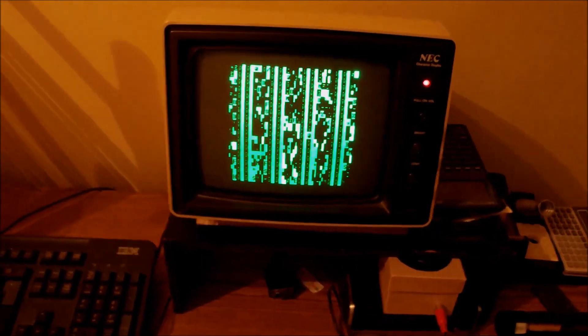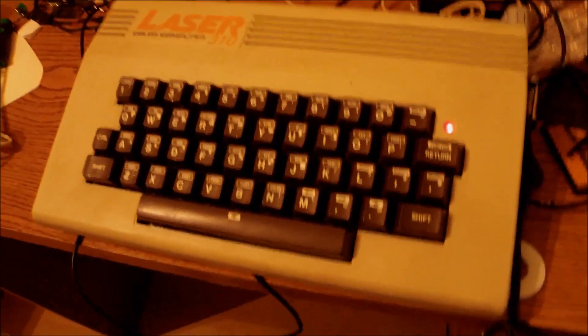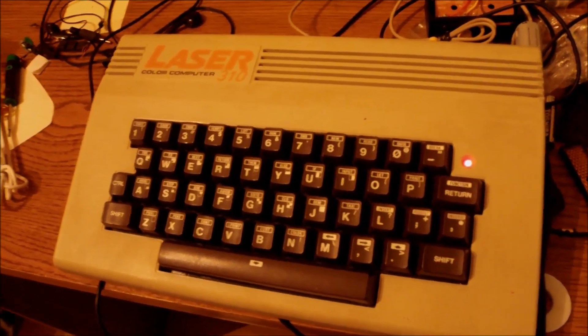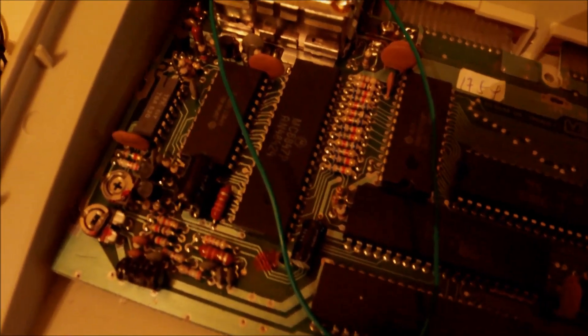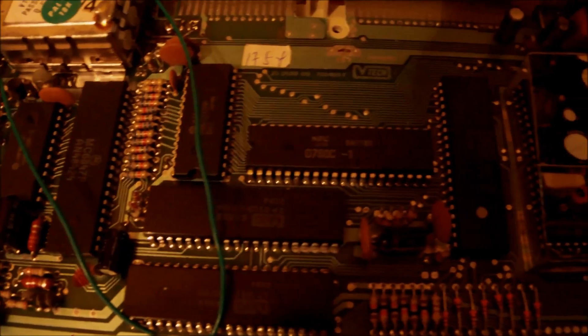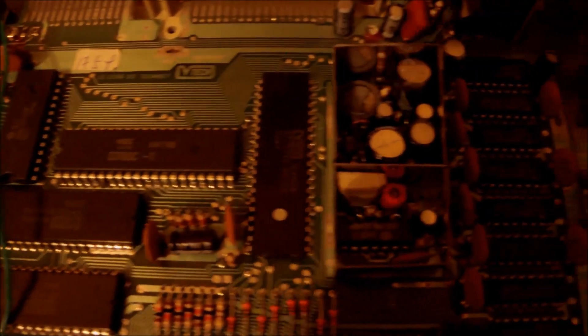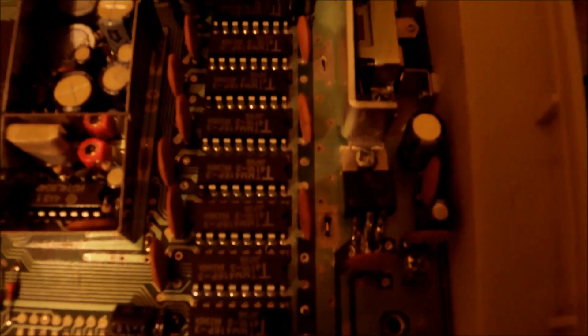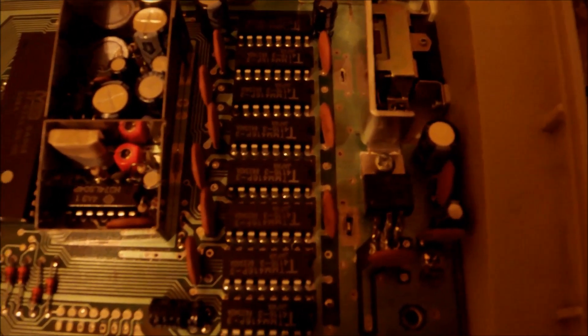I need to open this little fellow and check the RAM chips, and see if there is anything I can do. This is a very decent mainboard — very good looking, quite heavily populated, but the design looks good. We can see the Motorola coprocessor taking care of video, the Z80 and the ROMs, and the RF modulator. And here we have the 4116s — the RAM chips — by Toshiba, if I can see this right. I don't have any spares at this point in time, so I have to order some RAM chips and try to fix it.